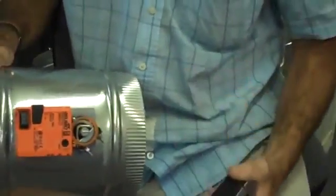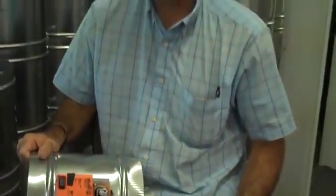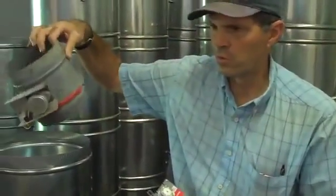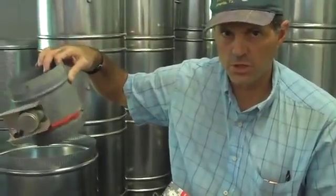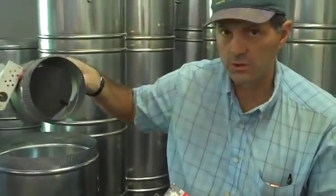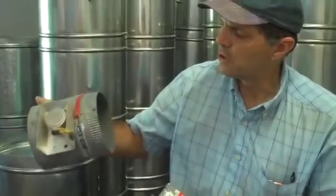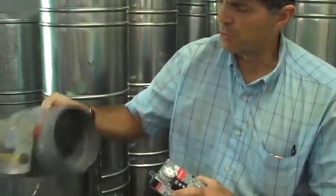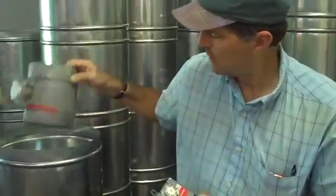That's a few differences. I hear I'm running out of time. I could talk for a lot longer because there are so many differences between really true commercial grade dampers and old residential grade dampers that are built cheap and look like it once you really start looking at it. If this had been in your home, you wouldn't have changed out that motor. You would have had to rip the duct system apart, changed out the whole can. It does make a difference.